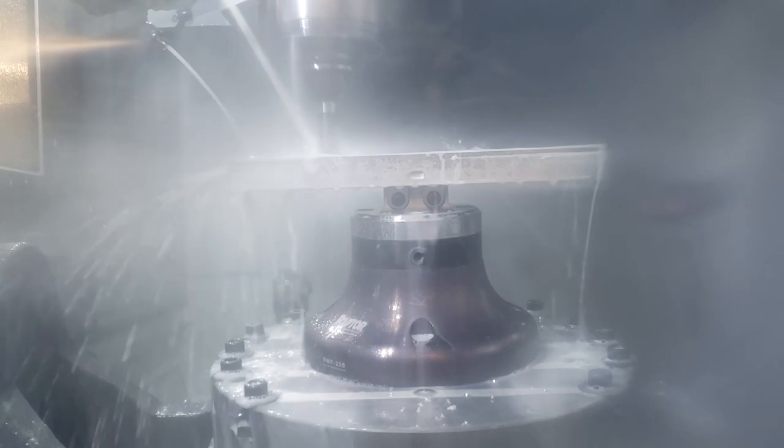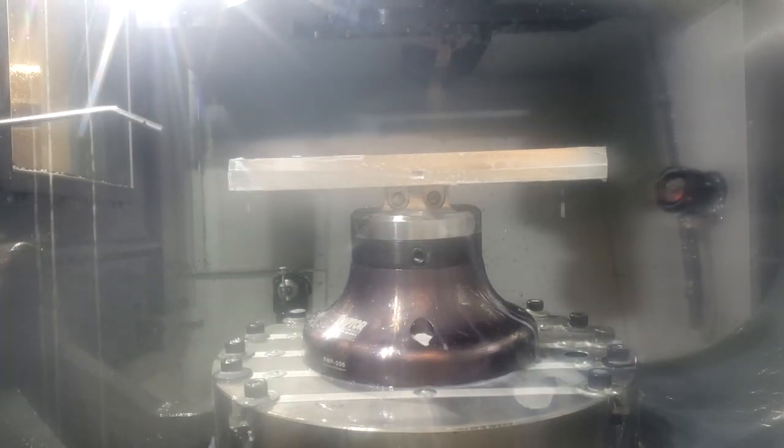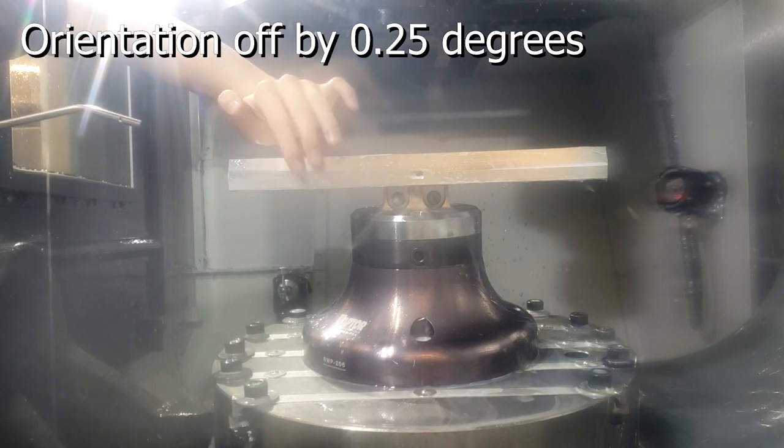An occurrence of chattering doesn't necessarily mean a part is impossible to machine, it usually means there's a better technique or approach to manufacturing that part. Poor work holding can also result in issues with parallelism, which is when features that are made in two different work holdings are not correctly oriented with respect to each other.